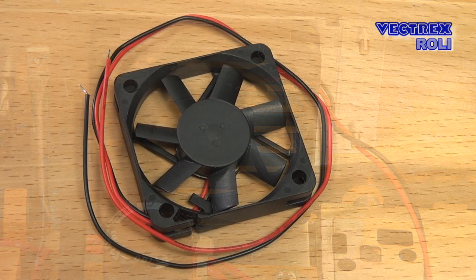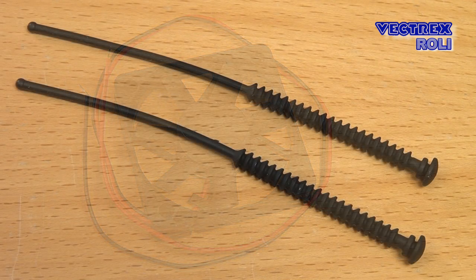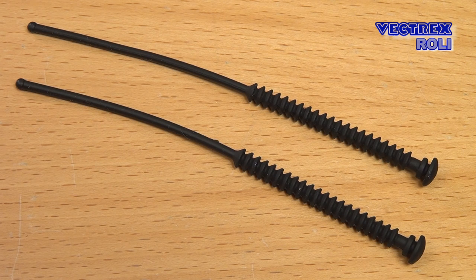So basically you can take any standard flat cooler fan that fits in there. I used a 12V DC model and put it between the 12V and 5V DC power lines, which results in 7V DC input for the fan. So my fan doesn't run at full speed, which reduces the noise, but it still runs fast enough to cool down the power supply and also other parts of the mainboard. There are other and more complicated ways to achieve that, like using temperature sensors or speed control models, but I always prefer simple solutions. I strongly recommend to use 4 silicon fan holders instead of screws.